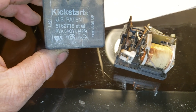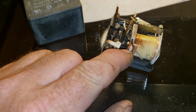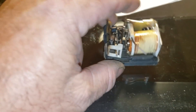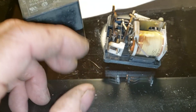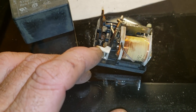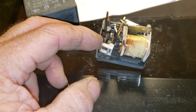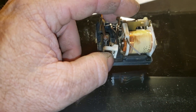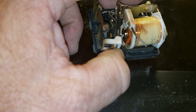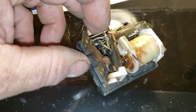So when you pick these, they usually tell you what voltage they are for the pickup. It's going to be higher than your 230 volts. I don't know if that 305 means anything — it could be what it is — but basically once the compressor's rotor gets turning, it makes back EMF. The voltage is higher than 230, enough to finally have enough current to pull and push down the plunger, and when it pulls it down, it pulls open those contacts.